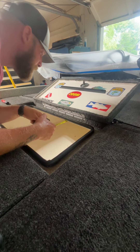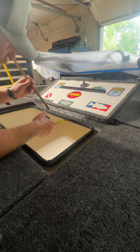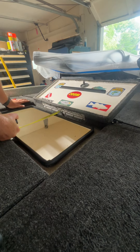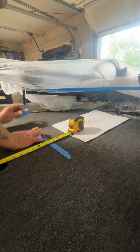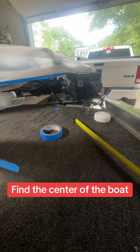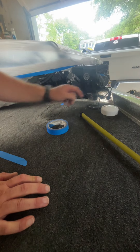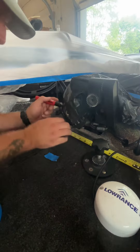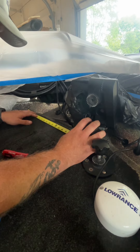To the outside edge of the box is roughly 16 and a half minus two inches, so we're 14 and a half inches — that's as far back as we want to come. Measuring across the front, we've got two points to work with: a corner here at the front, 27 and a quarter inches from inside bottom corner to inside bottom corner, and 13 and 5 eighths of an inch.